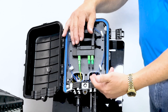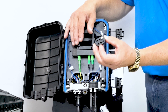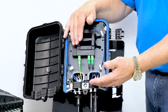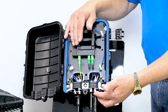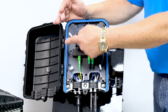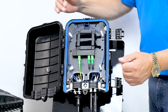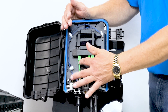Very easy to install here. The drops come into the drop grommet, which is basically your grommet right here, which allows the flat drop, round drop, or rock drop to come into the unit. Once it's secured and you follow the proper installation manual, you'll see right here we have some that are set up and secured with the strain relief. Coming in, we expose down to your 900 micron fiber, which is stored in the fiber management clips. We have protective ears on the side to help keep that fiber inside, and once it's secured in place, you come in and plug into the desired port.